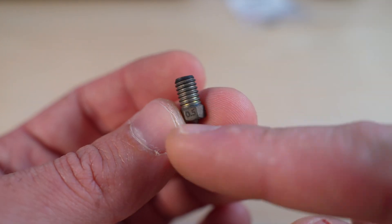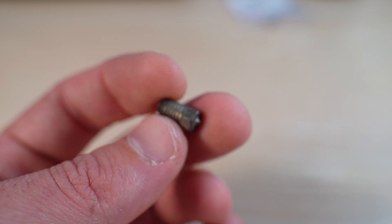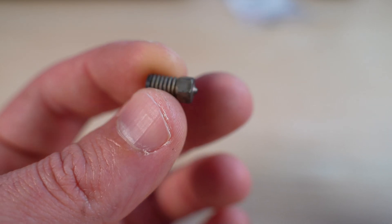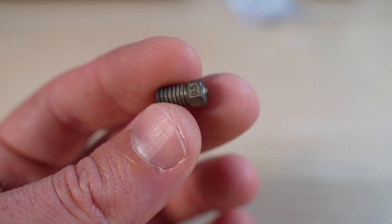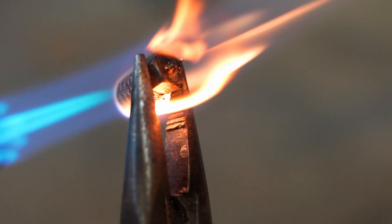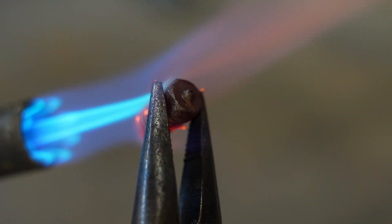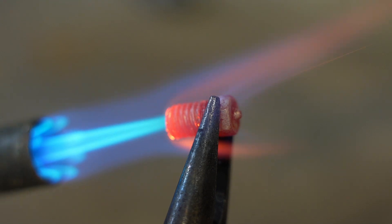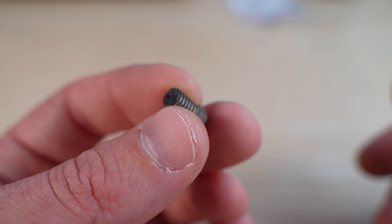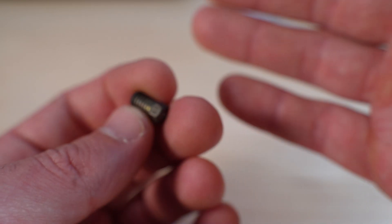For now, there's a new nozzle in town and it's something really awesome — this one is in tungsten carbide. I love tungsten carbide because it's abrasive resistant, it will basically never wear out, and you can blow-torch it glowing red hot to clean it. Once in a while when prints go bad, you just blow-torch it and install it back and it's like brand new.